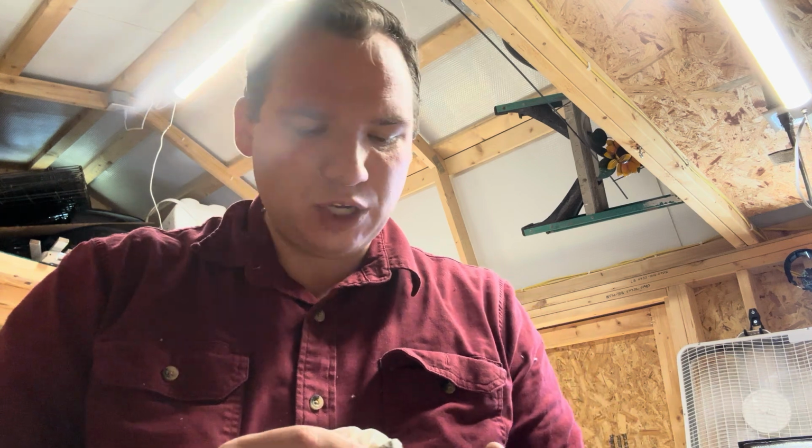If I didn't do that, I would have had to find a gunsmith. That's expensive stuff. Something that should have been caught in factory. I know these guns come off an assembly line, but you would think something like the cylinder pin would be checked, because you just pull it, bring it to half cock, push the button over, and pull it out. It's not a real big deal.